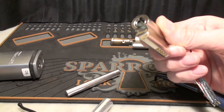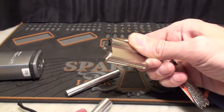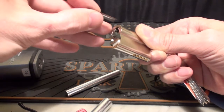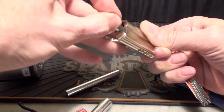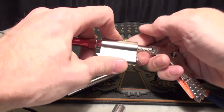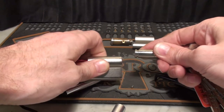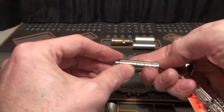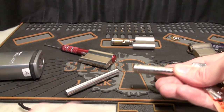Let me just check we don't have anything else the right size while we're at it. I think we can probably do it — if we get a double shim, I think we can probably do it with a pick handle. Let's go. We just lost a spring or two from the top, but I think we're going to be OK. These are my five pins down the bottom and these are my five pins at the top. I suppose we should knock out the pins at the bottom first.